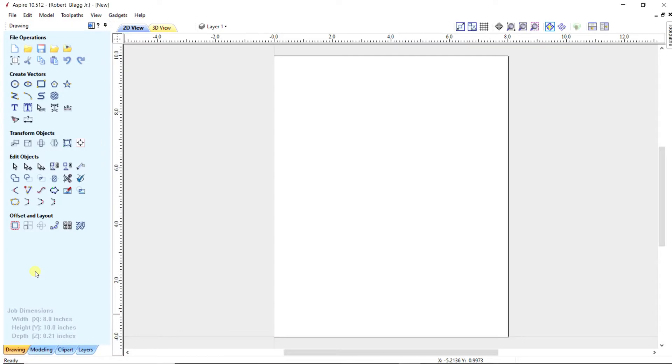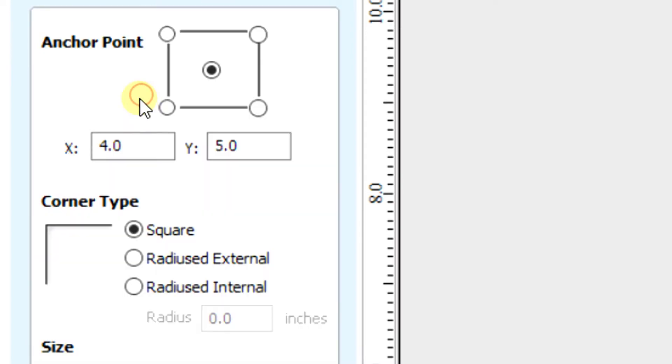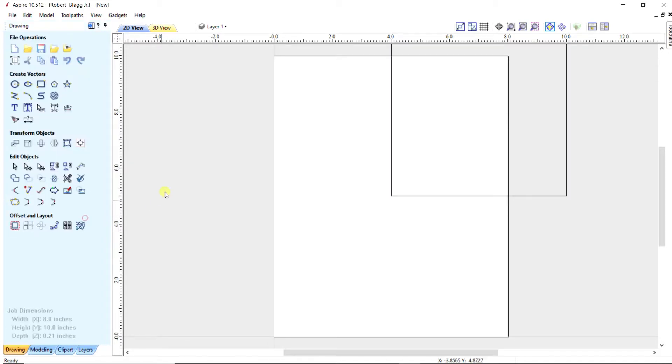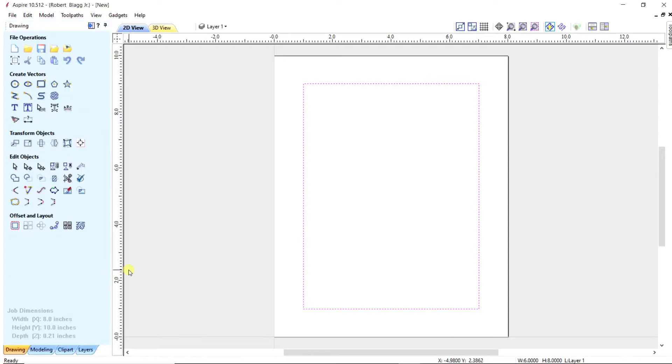You can make it however big you'd like. Keep in mind that the end result is going to be pretty thin, so you want to start with a thin material. If you're using the material that I'm using, it's 0.21 inches thick. First thing you're going to want to do is create a box that's about an inch smaller. You need to have a border around the actual ending part because it's super thin and it would more than likely snap in half, so make sure you put a border around it.